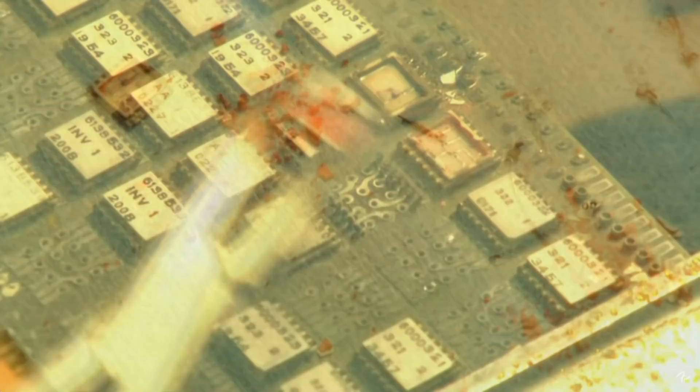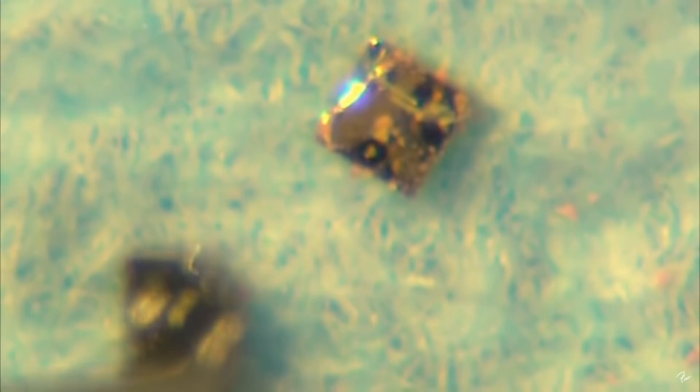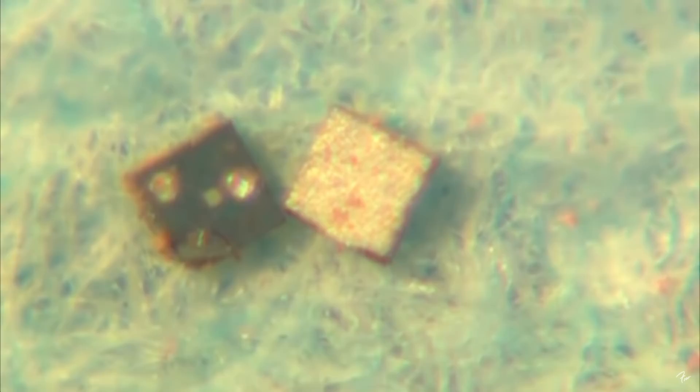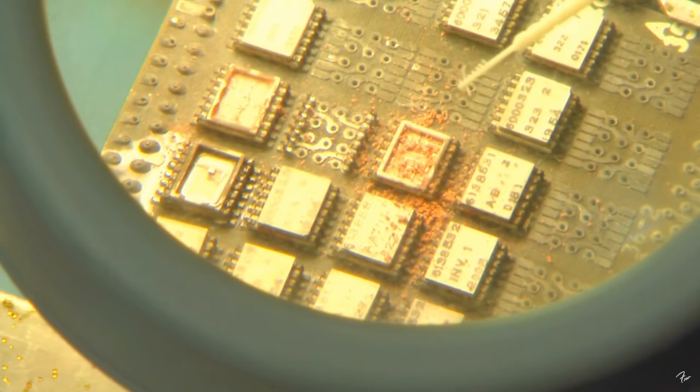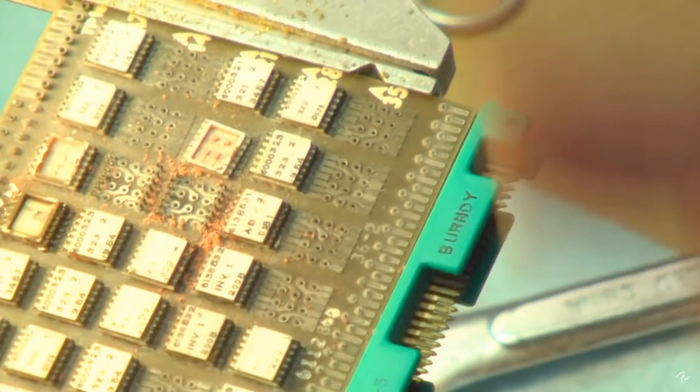I just got one strand of that tiny plastic brush. There it is. A little bit of potting still inside, but you can definitely see the traces there. There we go. It is out. Success! High — 0.64 volts. Take the last input and switch it high — output is 5 volts. It's an AND gate.